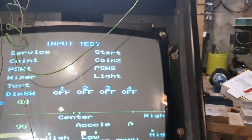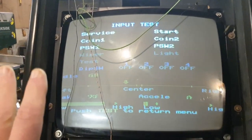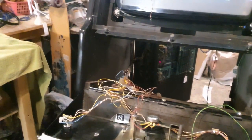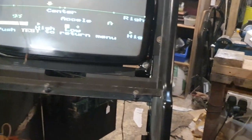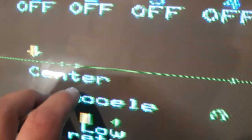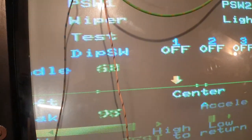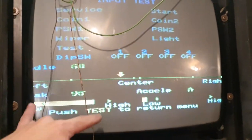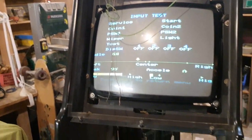Still some calibration work and a new pot needed. Not going to touch the monitor for now — just try to get as close to crisp and normal as possible. Happy that things have started up. The monitor has some color bleeding, colors aren't quite right, and the width is off. If it needs a recap I can replace the caps. The pleasant surprise is the board is working — I genuinely thought this board was toast.